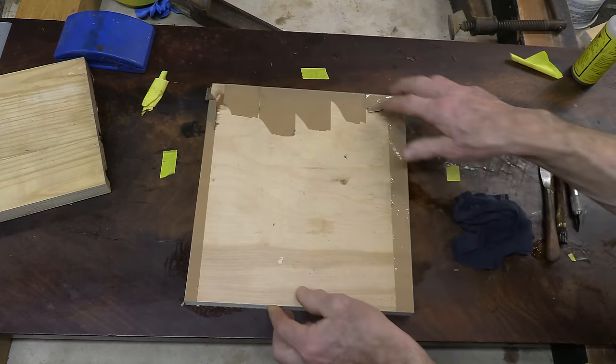Okay, the top has dried really well overnight, but I'll let it continue drying. And in the meantime, I want to get back on this base repairs. This is the same Van Dyke Brown, thinned out Van Dyke Brown dye stain that I've been using all along. These smaller chips like this along the bottom edge, I'm going to fill with epoxy putty. And then the same stain.